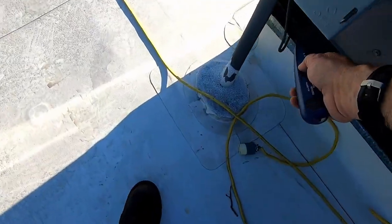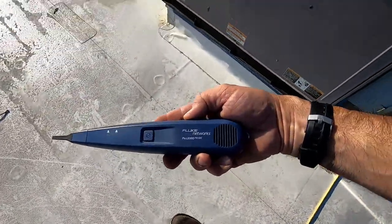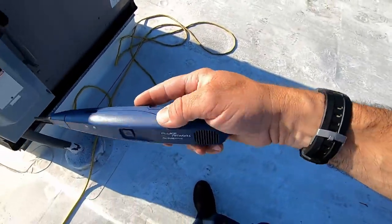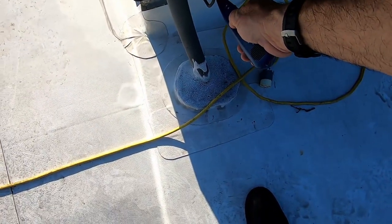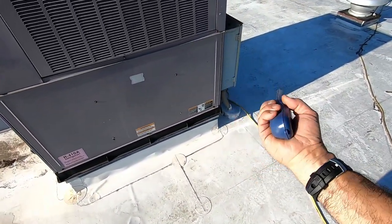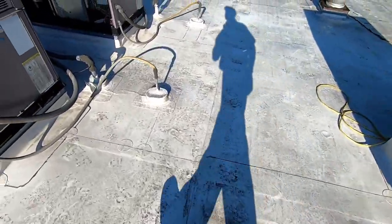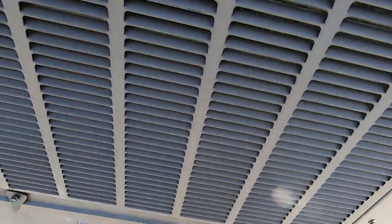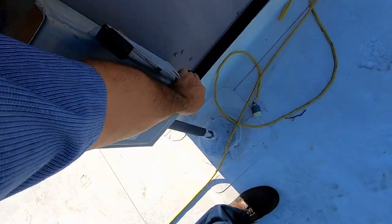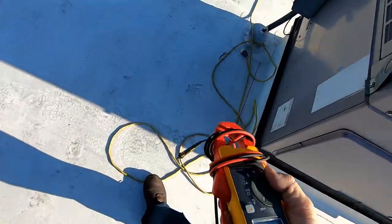Look at that — there it is. It's a Pro 3000 probe. I'll put a link in the toolbox section on Amazon. What I did was pick G and W because I knew they probably wouldn't be shorted together on the circuit board. So this is the waiting room unit — I'll write that on it with a paint marker so it lasts. Now, when we got up here, this unit wasn't running, so let's check high voltage and see if there are any issues.